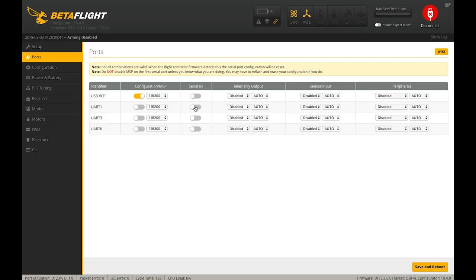Let's start with the receiver. There are two functions: the SBUS input is hooked up to UART1 RX inverted, because SBUS is an inverted signal, and we made sure to do the solder bridge to connect the B pad and the SBUS pad so the flight board will receive that inverted signal properly. We're going to check serial RX for UART1. The smart port telemetry needs its own UART and an inverted UART, so we soldered the smart port wire to UART1 TX. We'll set up a soft serial and come back to that.